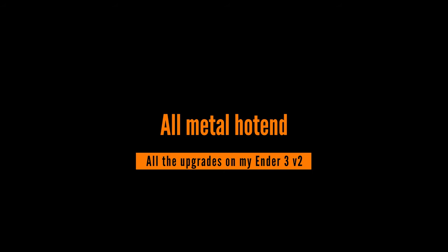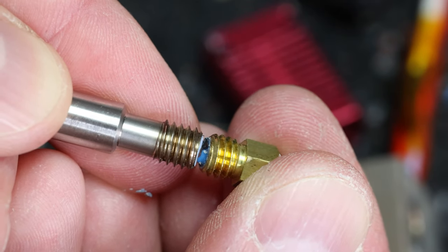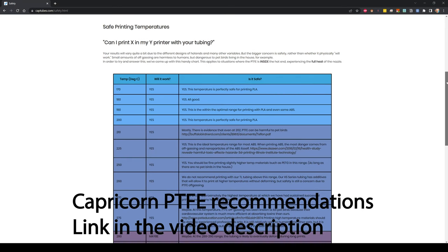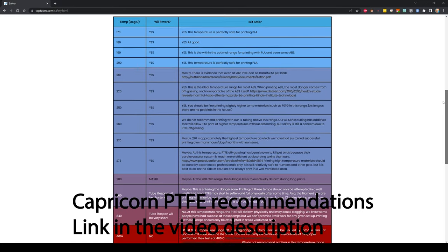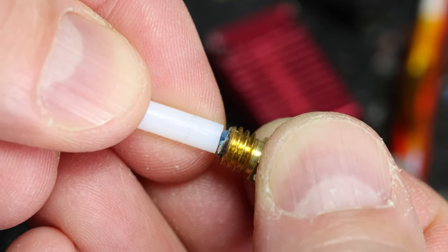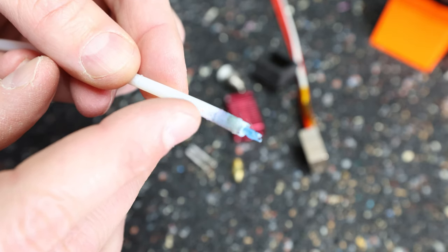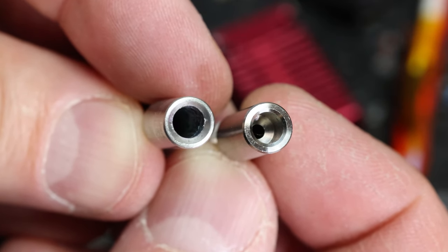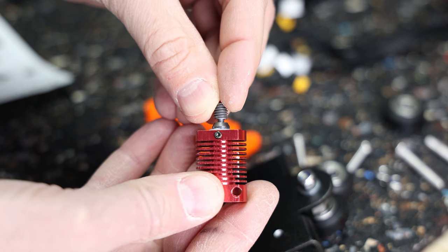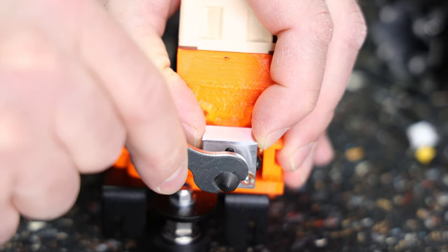All Ender printers and most Creality printers have the same hot end style where the PTFE tube goes down to the very end of the cooling block, touching directly the threaded end of the nozzle. That means printing at higher temperatures than 230 degrees Celsius risks damaging the PTFE tube and can cause toxic fumes. The setup is also more prone to clogging because there might be a little gap between the PTFE and the nozzle, and if fluid filament gets into that gap and cools, it may cause a clog. This happened to me so many times that I decided to swap out the throat to an all-metal version from Slice Engineering, where the PTFE ends only in the first few millimeters and the rest of the path is all metal. It's also coated on the inside so filament won't get stuck, and the lower end is tightly screwed against the nozzle in the heating block so there is never going to be a gap.